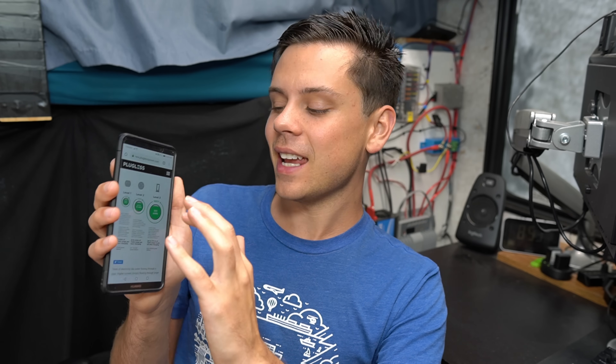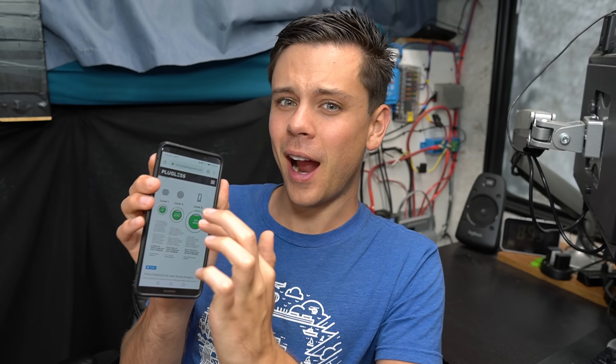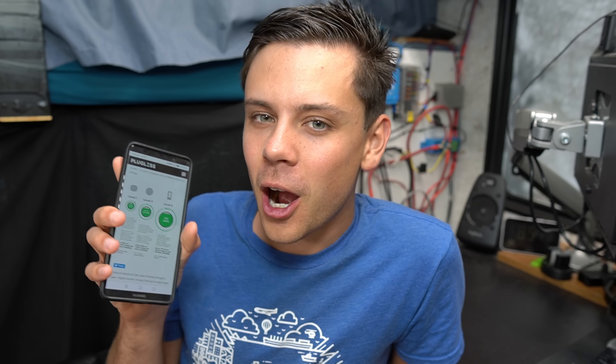To design this system, we need to figure out how much power we need to charge these electric vehicles continuously. I looked up the charts for Tesla — a good reference for all EVs, because if you can charge a Tesla you can charge the others since they have the fastest charge capability. Level three is insane — 480 volts and 300 amps, that's 140,000 watts going into a Tesla. Level two is 240 volts and 80 amps; to build a solar system for that speed you'd need to spend $30,000 to $50,000 in solar panels alone. So what we're limited to is level one charging: 15 to 20 amps at 120 volts, which is 1.4 to 2.4 kilowatts. I can trickle charge a Tesla with solar power — but the other options are just unrealistic.